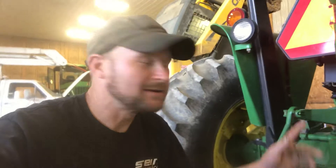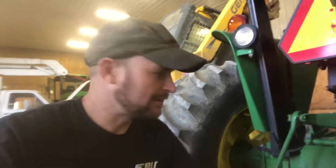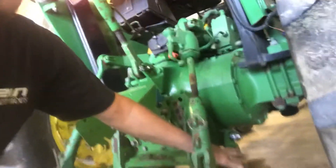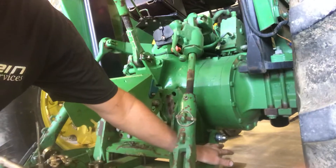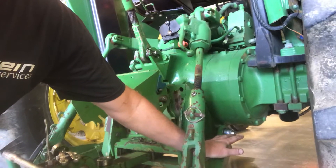How's it going today? This is Brad with AftermarketTractorParts.com. Today we're working on a 2555 John Deere tractor — load shaft seals. They're down here at the bottom of your draft arm links. They leak often on John Deere tractors. If you've ever owned one, you've probably replaced one. Common problem, but a pretty simple fix.